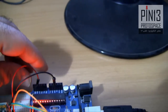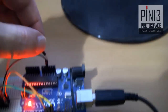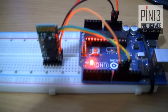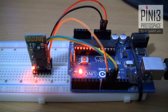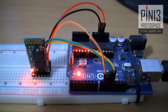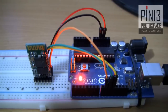The moment I connect power to the HC-05 via the Arduino's 5-volt pin, you will start seeing a 2-second blink. This means that the HC-05 is in AT command mode, or settings mode, or configuration mode — whatever you want to call it.